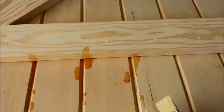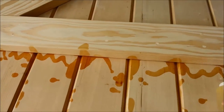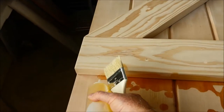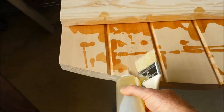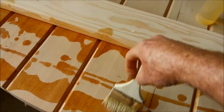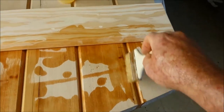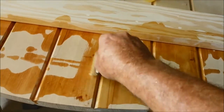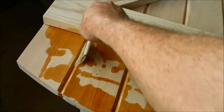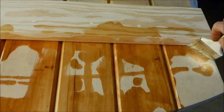I'll use the brush to even things out a little bit. This is the top of the door where water is going to get in at some point in the future. I'll probably end up using about two quarts of material on this door. You can see how it's so watery that it just soaks right in immediately. I'm going to even it out and go over the whole door and all the cracked areas to get this sealed up. Of course we're going to put a regular primer over this, but what this is doing is getting into the wood and making it so waterproof that it'll never have a problem.